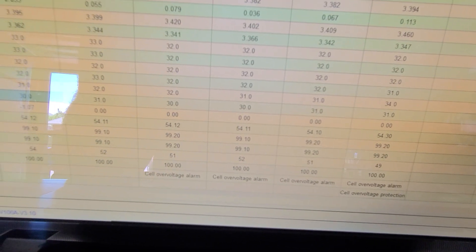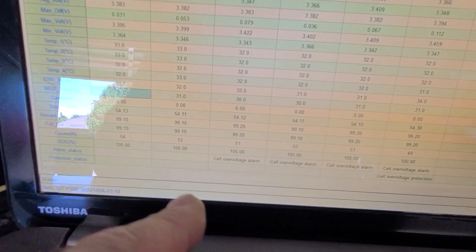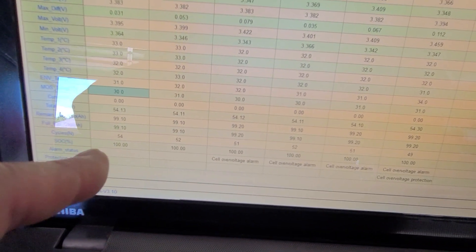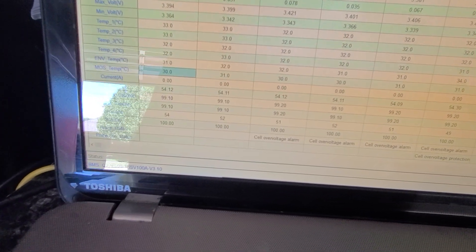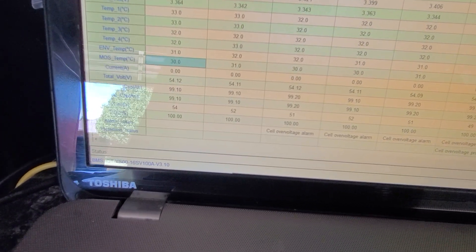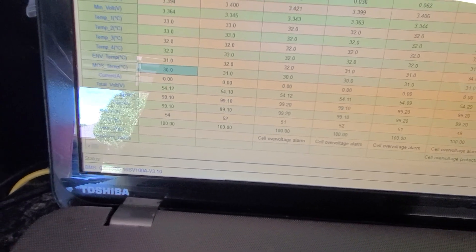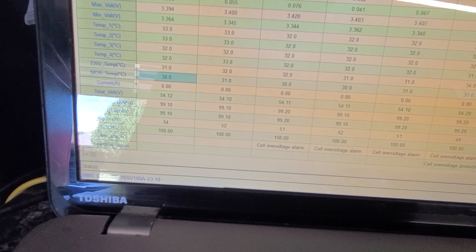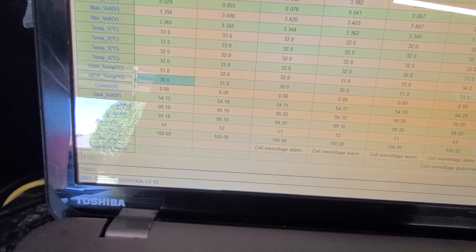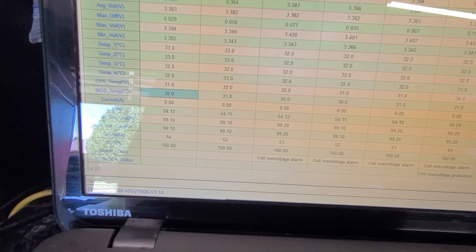During drain-down overnight, the SOC drift — they're all showing 100% right now — is about 4%. When I recharge them it goes back to 100% and they all just do it again. Cycle counts are 54, 52, and 51, and these are rated for 7,000 cycles — it'll outlive me at that rate. I'm not even cycling them all the way down, maybe 45 to 50% state of charge, and I don't think that even counts as a full cycle.